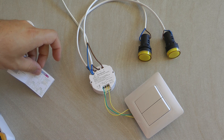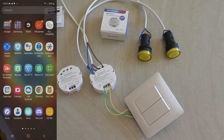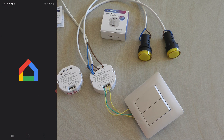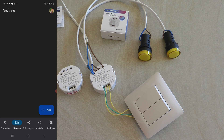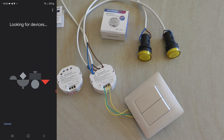The printing on the box makes more sense for how it's supposed to be wired. Now everything is working correctly. It's time to set it up in Google Home. I'm logging into my home app — I'll assume it's still in pairing mode — so I go to Devices, Add a New Device, confirm my address, and it starts looking for a device.